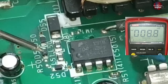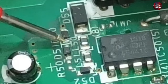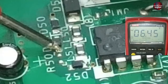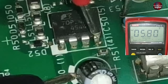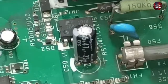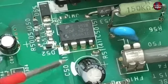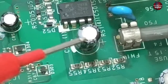This is an 8.2 volt zener diode mounted in reverse bias. This means that any voltages greater than 8 volts will cross from here to the cathode. 6.45 volts is coming to this pin. On this diode, we are getting 5.8 volts. So we're getting 5 volts at pin number 4 of the IC, which is its feedback pin — that means it is working properly. Pin number 1 of this IC is for overcurrent. If the voltages are correct and the current is getting high, this pin turns off the entire circuit board.